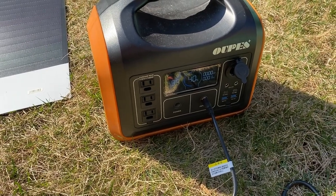This drops down to zero — are you actually surprised? Because I was very surprised that the CIGS panel with very little shading — actually less total area shaded compared to the Blue Eddy — drops to zero. Another benefit of the Blue Eddy is it has a kickstand, it's easy to carry, while the other one is a big rolled-up thing — more suited for a portable or permanent setup, like on a south-facing wall that gets sun all day. The moral of the story: shading is an enemy of solar panels, and specifically the Rich Solar CIGS technology did not deliver as good performance.